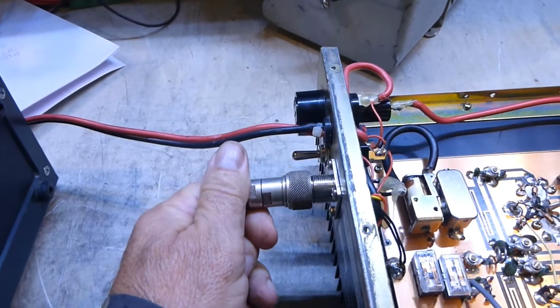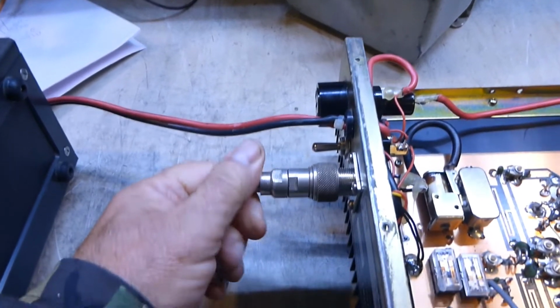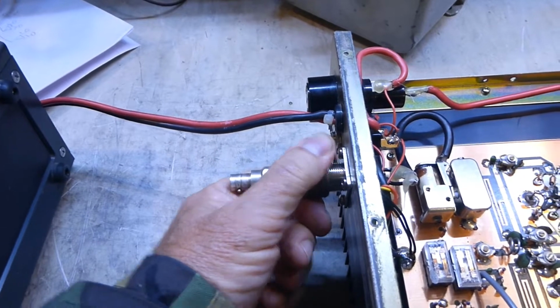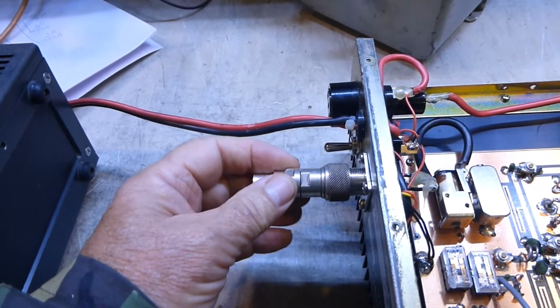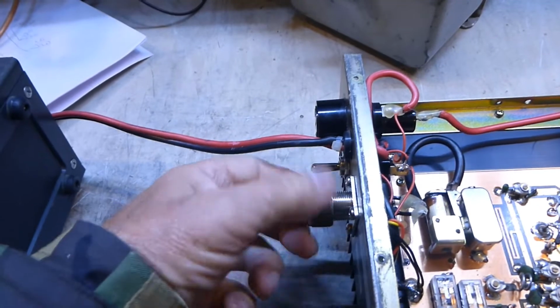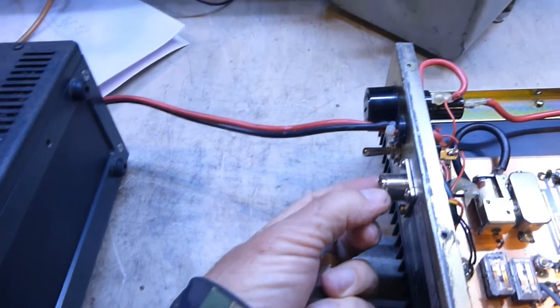So when we put a connector in and we rotate it, and that is now tight, you can see that the body of the connector isn't actually grounding. So that would have been working into an antenna without a ground, and I reckon that's a very likely cause of it tripping. Now, on normal UHF connectors, PL259s, they have 2 V's which should locate in these little slots.